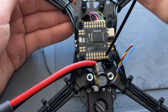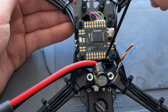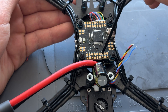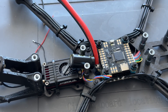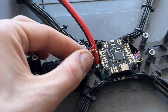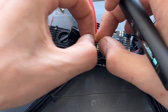Now we have 4 wires from the VTX. Black is ground. Red is DC in — the positive power line — and it needs at least 9V. Yellow is the video signal, labeled VTX on the flight controller. The last one is a data pin, which should be connected to any UART — you'll see the nearest one labeled TX4. Soldering this part is much easier: switch to a smaller soldering tip and reduce the temperature to 300°C. Cut the wires to the right length, tin them, and solder them in place.